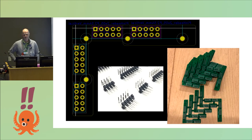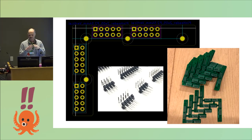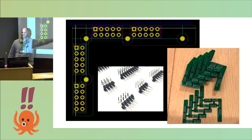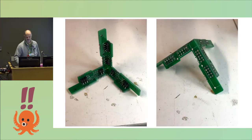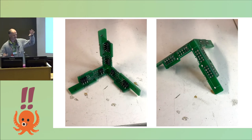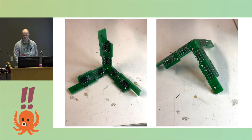For the mechanics, I decided on a pyramid structure built out of three identical legs. With a caliper, I had to be really precise to find exactly where the holes are on the LED matrix panel. Then I used right-angle connector pieces to basically solder them all together, forming the structure that keeps everything in place. Then it was time to assemble.